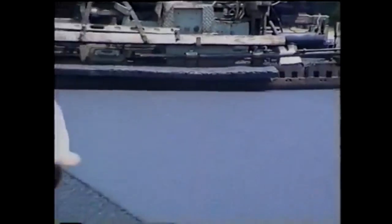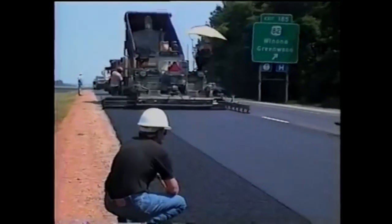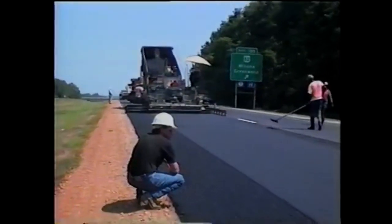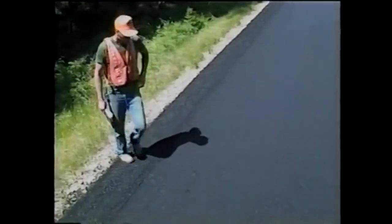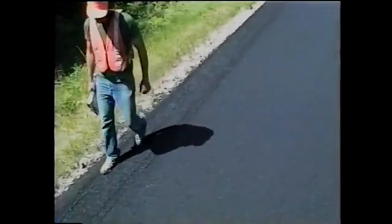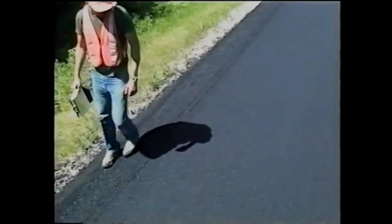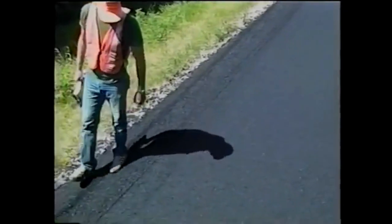Check the overall quality of the mat — it should be smooth, uniform, and free of blemishes. If it's not, something is wrong with the paver or the mix. Look closely for segregation; if the texture of the mat isn't uniform, the mix has segregated. Inform your supervisor and the contractor right away. We'll look at some examples of mat problems in part three.